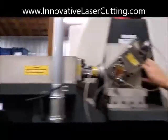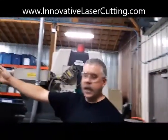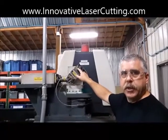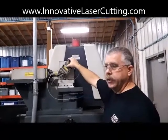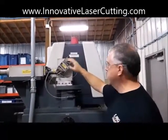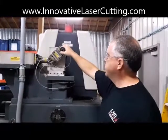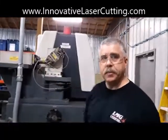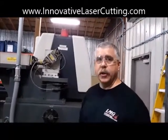The laser beam is generated in this cabinet. It bounces off a series of mirrors that shape and turn the beam, anti-reflective, sending it down to the cutting head. Every one of these stickers is telling us that if I take that panel off, there could be a laser beam behind there. If you're doing maintenance you know the beam isn't just shooting out — you know how to do your maintenance. You take these off, inspect the mirrors, line the beam up centered on the mirror mount targets, and move on. But this is a required warning: if you take this off and turn the laser on, the beam will come out and you won't see it — it's in the infrared. You won't know. It will start a fire somewhere when it eventually hits.